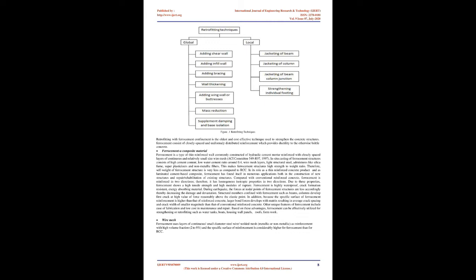The vast majority of earthquake fatalities in the last century have resulted from building failures in developing countries like Nepal. The greatest risk is by far presented to inhabitants of non-engineered low-strength masonry structures, as demonstrated in the earthquakes of Bam, Iran, 2003, Pakistan, 2005, and Pisco, Peru, 2007, where many of the thousands of deaths were attributable to vulnerable low-strength structures. To restore the required strength of the deteriorated structure, retrofitting is the solution.